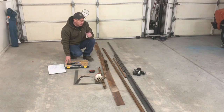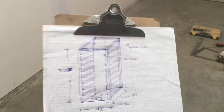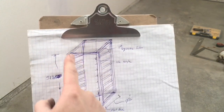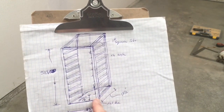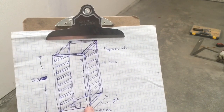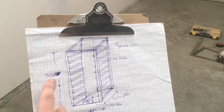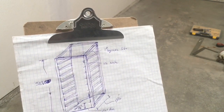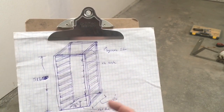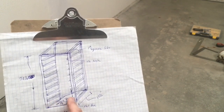What we've got is all cutoffs — I got one long 18-foot piece that I'd cut something else off of. We're going to build a rack using one-inch square tubing for my four uprights and my upper crossbars, and for the back and two side lower crossbars. On the front piece we're using a piece of flat bar to make the first shelf at the very bottom, then inch-and-a-quarter angle iron to make the slides where the boxes will slide in. I need 50 inches inside to get all my boxes in there, 13 and a half inches depth, and 16 and three-quarter inches inside to inside on the two angle irons.